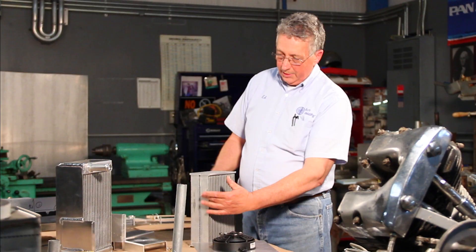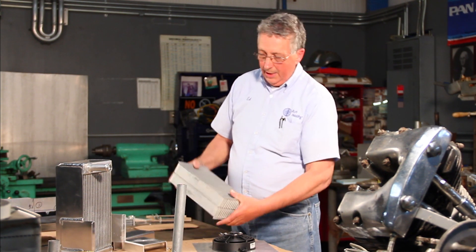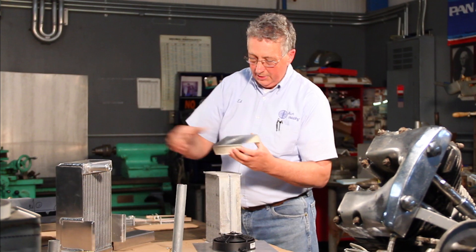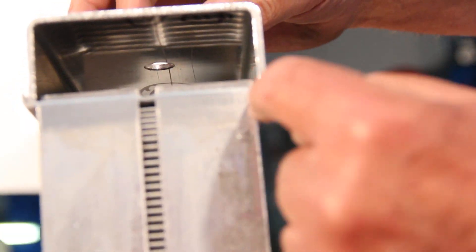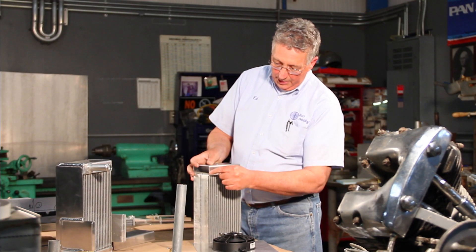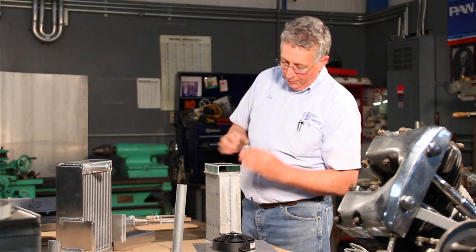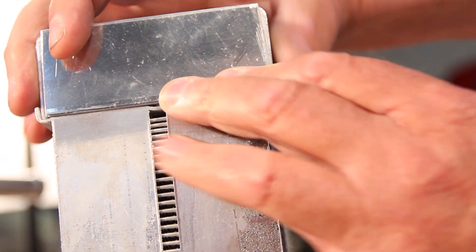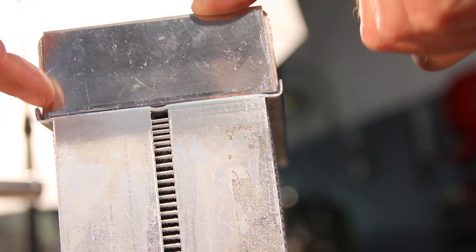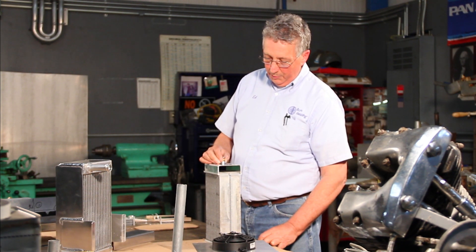When a customer gives me the specifications for the width, I can cut it down, and then what I do is I bend my tanks as you see in the sample here. This all gets cleaned down — you've got to clean all the welding flux out. This gets put on like so and will get TIG welded here, and then there are end caps that get put on. This gets all welded around here and down here, and then I put in a drain fitting like so.